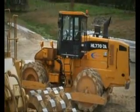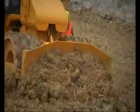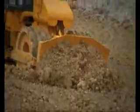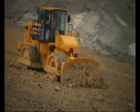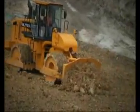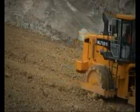The second reason is that these wide feet allow for only four rows per drum against five on the original. Four rows equals three gaps to clean; five rows equals four gaps to clean. Three against four equals a clear 25% reduction in drag — no question, 25%.